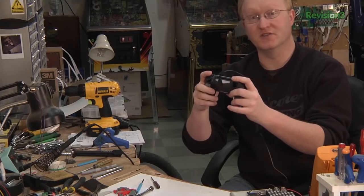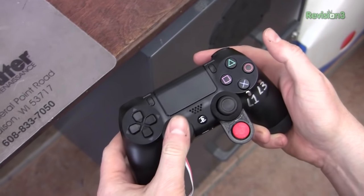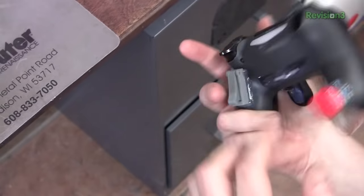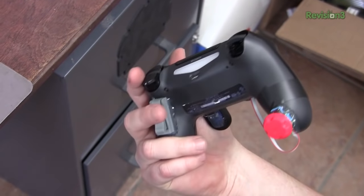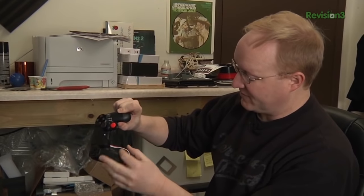I think this controller is good to go. Here's the controller: the left analog has been moved here, L3 — which is when you click in the left stick — has been moved here, and the left analog is on the bottom for moving your character or cursor on screen. What we've added is the L2 button over here. It all went together pretty nicely. The only exposed wire is on this analog stick — we could snake it through, but you might hit the rumble motor, so it's easier to have one wire exposed than to lose the rumble motor.